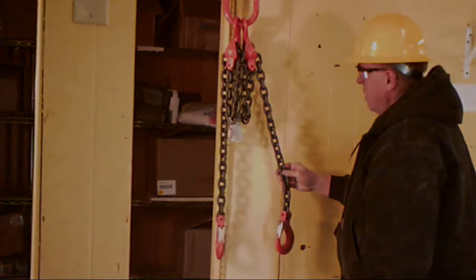Note how the horizontal chain link never touches the saddle. The shoulders of the downside link take on the weight of the load, giving you the full strength of the chain with no possibility of bending the chain link and compromising your lift.